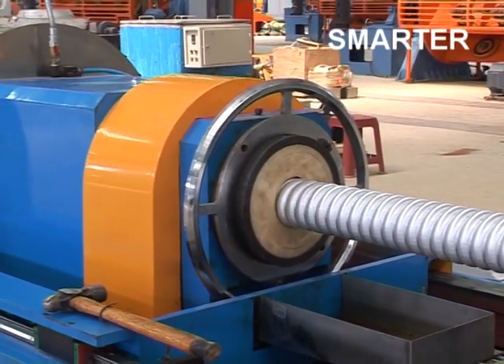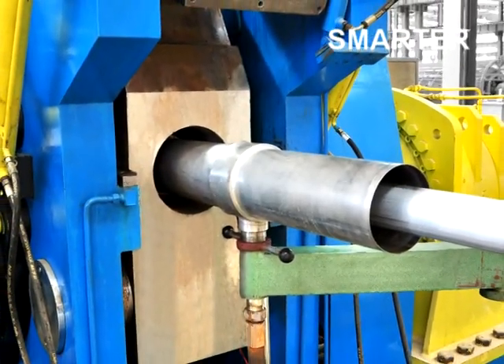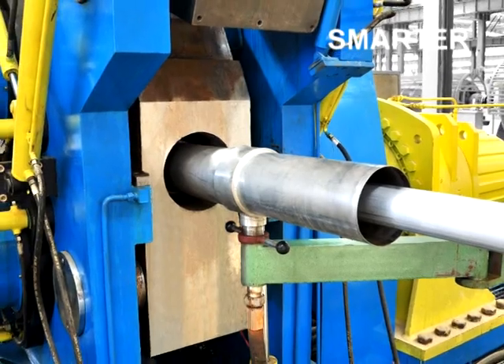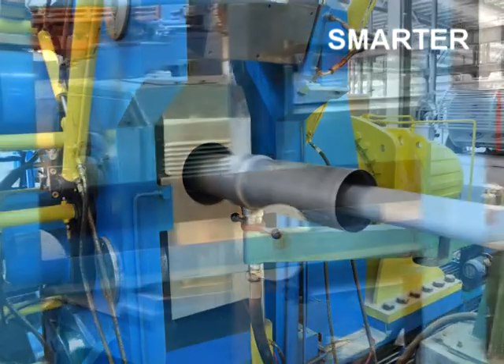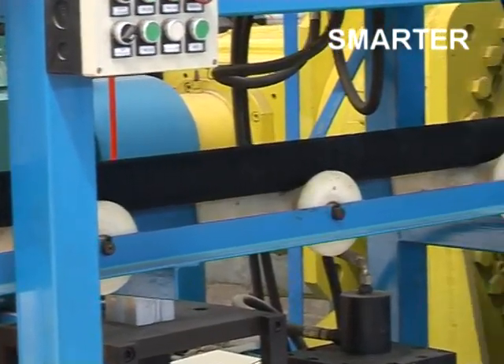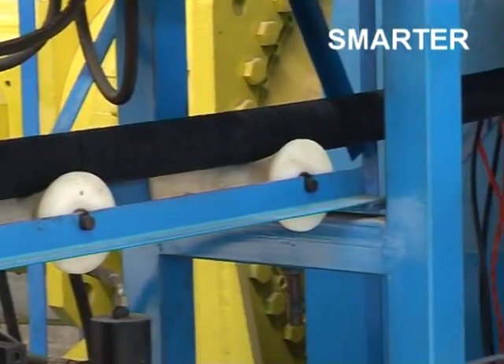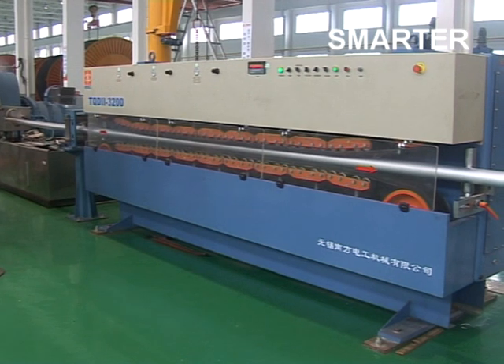The main characteristic of the aluminum cladding continuous extruding line is using up and down symmetric extruding wheels. The die block, die core, and die bush form a symmetric extruding material passage. Aluminum rod goes into the extruding cavity formed by die core and die cover, then becomes a metal aluminum tube through even extruding pressure and speed at the outlet of the die.